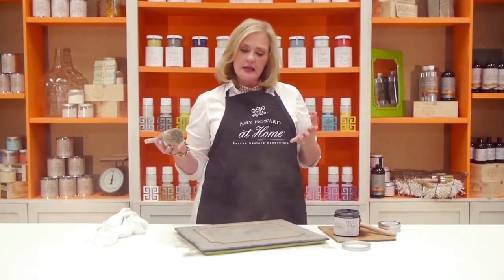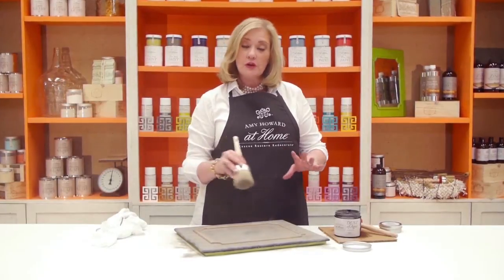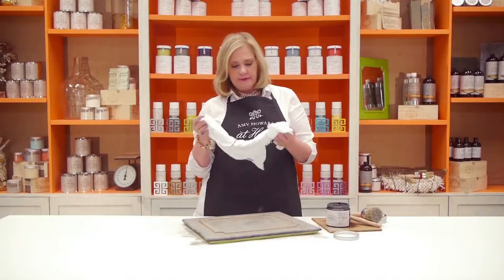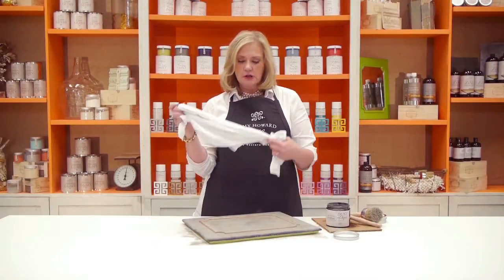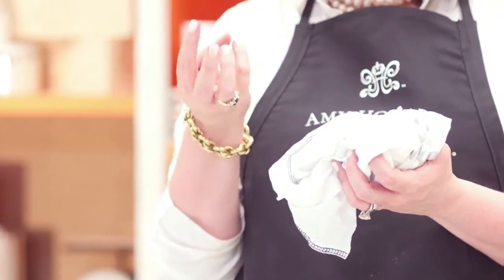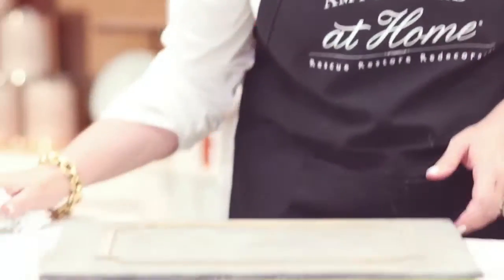A lot of people will say, can I reuse this? If you want to dust it off and put it in a little container, put it back in the jar — absolutely. I'm using a lint-free rag. You'll see I've got a large rag, not a small piece, because as I'm buffing it, I want to make sure that my fingers don't show through. Buffing like you would a shoe — think about that motion of a hit-drag buffing. That's how I'm going to buff my cabinet.